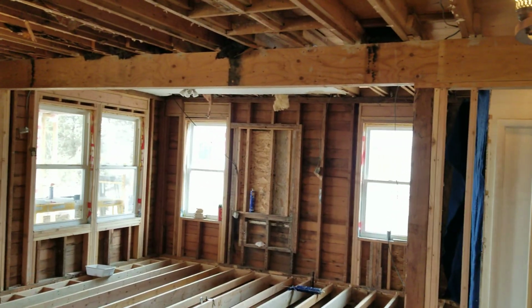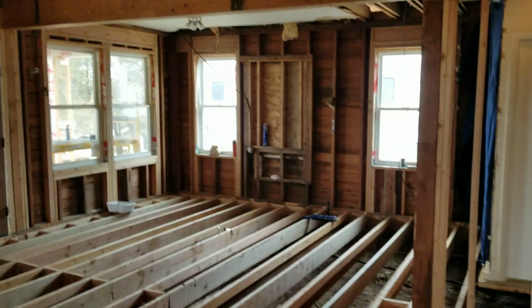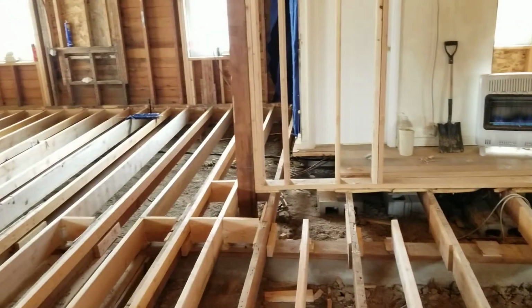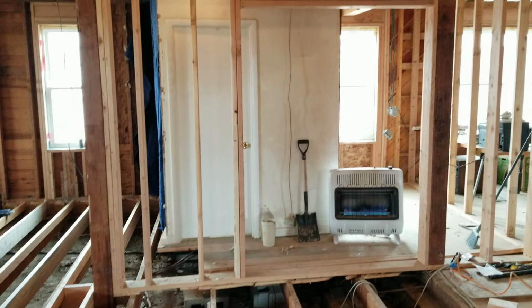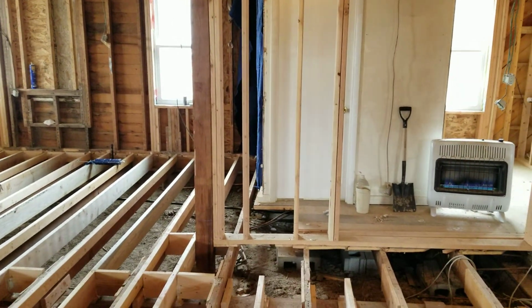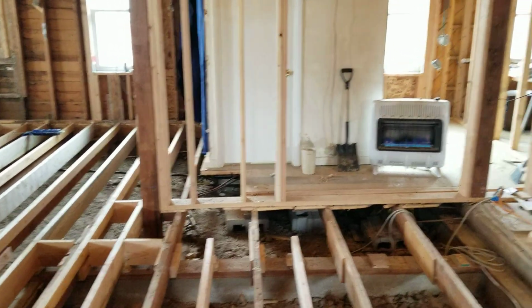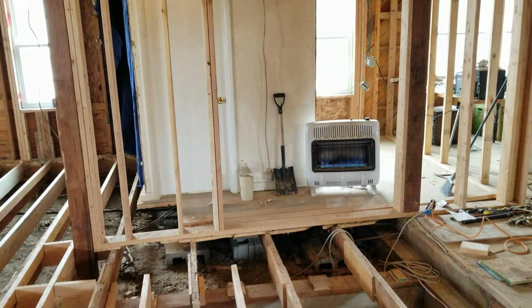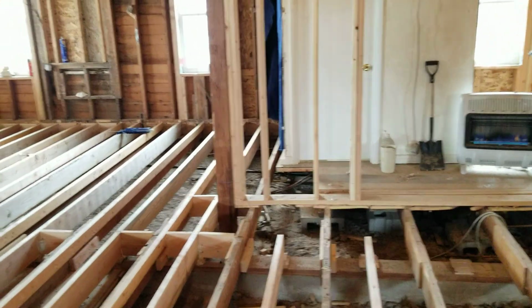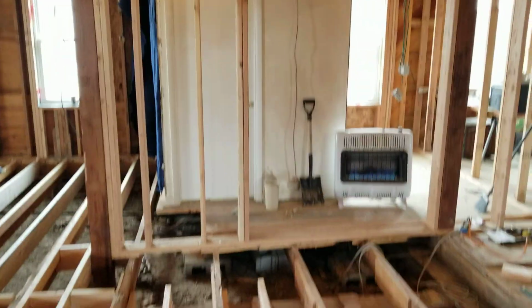And then once we started measuring to the floor, it's like, well, how come it's different from the floor? Well, the floor's not level. So the floor will be level now. I had to do my new framing on top of the old unlevel floor, just because that's the stage they were at. I said, look, I can frame your new office like you want it and you can leave the floor unlevel like it was before, which is not ideal. It's the wrong thing to do. Or you could laser level it.